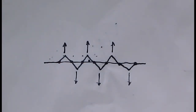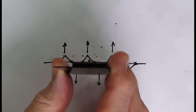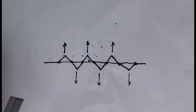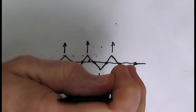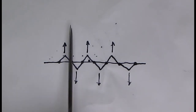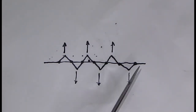Before showing a close-up of the damaged blade, I want to show you how the blade looks. With the blade facing the camera, those teeth are slightly offset — staggered in each direction. They're not all flat; one goes in, one goes out. When you file these, you're going to file them to match that in-and-out pattern. The ones going this way, you file this way; the ones going that way, you file that way. That reinforces the slight angle in the blade.